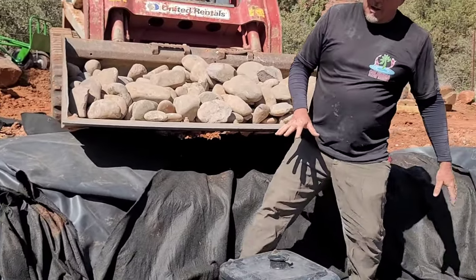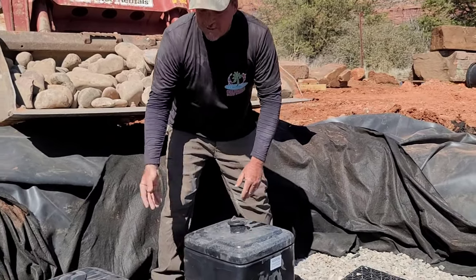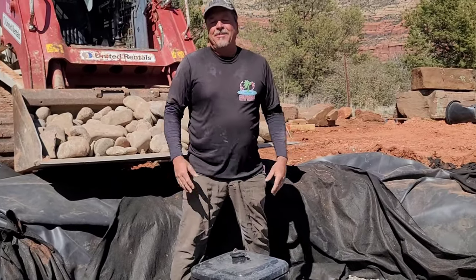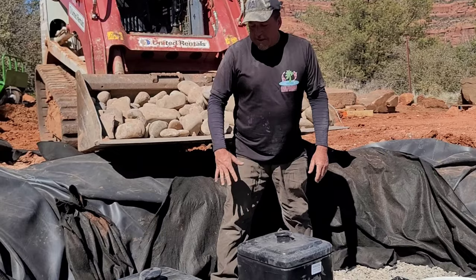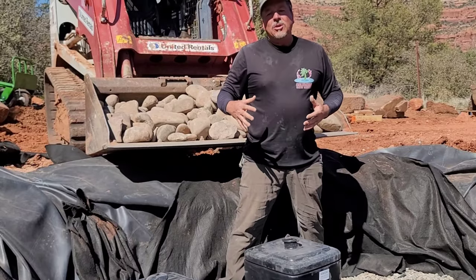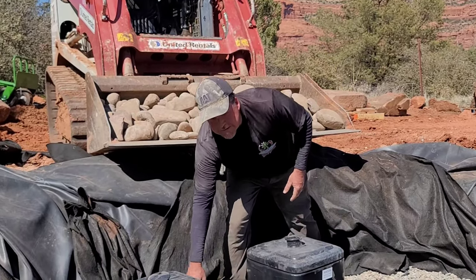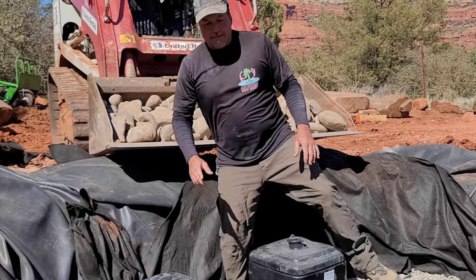When you slide on your vault extensions, don't forget to plug off the holes on the bottom. Use something creative. Gorilla tape works just fine. It's not going to go anywhere. It sticks. Another thing you could do is take some underlayment, wrap it around and tape it, and then put your rocks down. Anything you can do to get creative to keep the rocks from wanting to go in through the sides. That's it. This is about as textbook perfect as it gets.